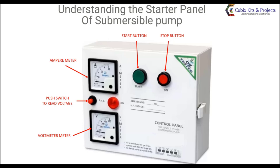Once the motor is started by pressing the start button for a duration of 2 to 3 seconds, the initial current draw may reach approximately 20 amps. However, upon releasing the start button, the current should decrease to around 10 amps. If the current fails to decrease to half its initial value within 4 seconds, it is essential to promptly press the stop button to prevent potential motor damage.